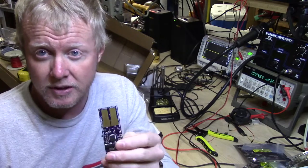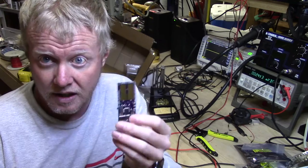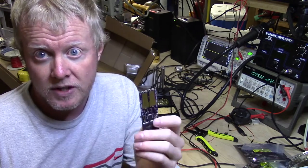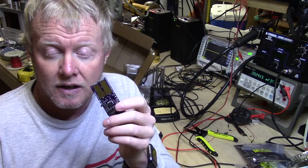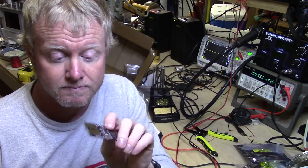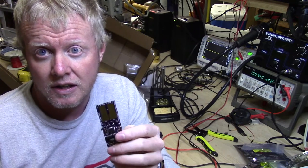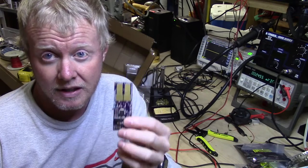So for people that just want a little more advanced control and a lot smaller package, and to me it's a lot simpler to wire, mainly because, one, you don't have to run heavy gauge wires up into the actual dash area. You can pretty much keep all your wiring really close, right to the terminal point. And two, this is going to do neat things if you want to actually have accessories on. You can extend the timer, and that's exactly what I'm going to do here.